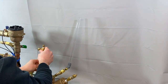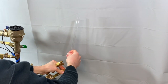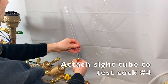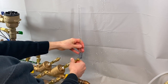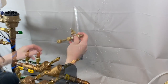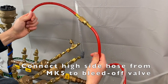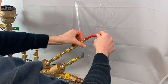The test of check valve number two. If test cock number four is not at the highest point of the check valve body, then a vertical tube or pipe must be installed on test cock number four so that it rises to the top of the check valve body. Attach the bleed-off valve arrangement to test cock number three.